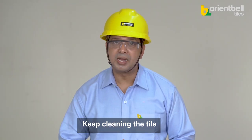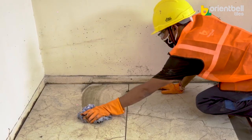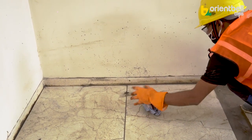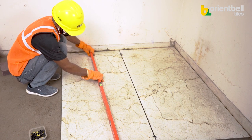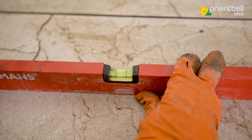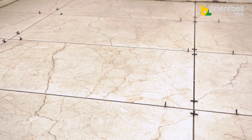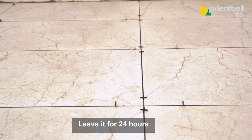Don't forget to wipe away all dirt and cement leftovers from the tile surface using a dry cloth or wet sponge — be quick, otherwise it becomes hard to remove. While tiling, periodically check the level of the tiles with a spirit level; this is very important. After installing all the tiles, clean them and leave for at least 24 hours.